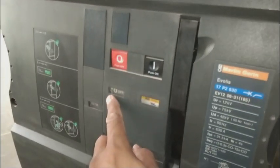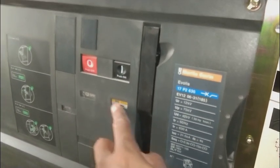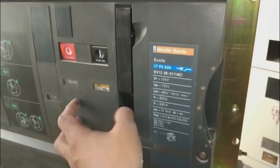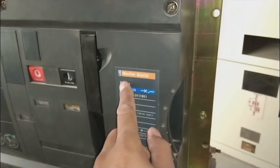This is the front of the circuit breaker. Here is the manual charging lever — if the spring is not charged automatically, it is charged manually. This indicator shows the spring condition — whether it is charged or not. At the moment it is charged and showing the charge indication. There is a motor inside connected to the 110 volt battery protection voltage by which this spring is charged; if not charged automatically, you charge it by hand.